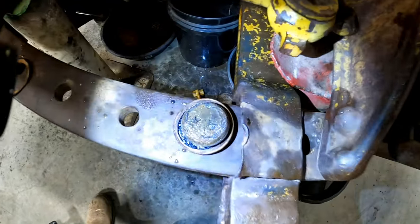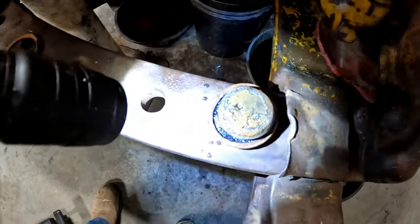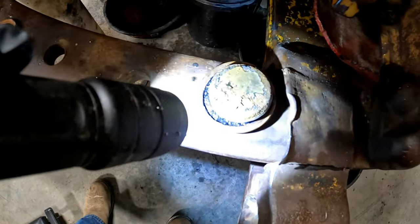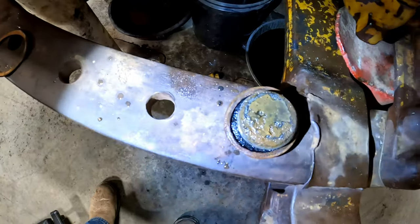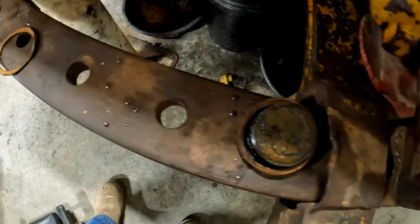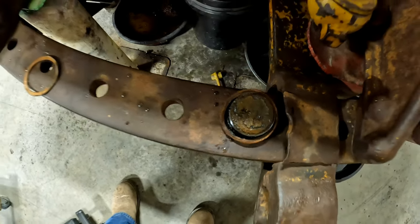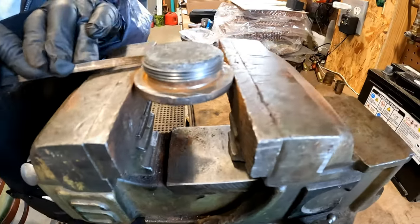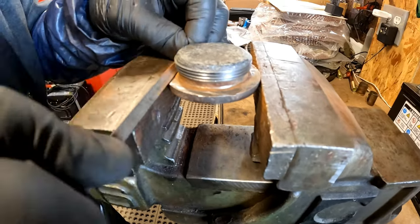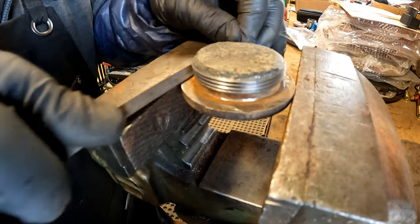What Dad's saying is this copper ring being the wrong size here, the water got down in there next to it, and it made a rust ring around the bottom of the plug, and that is why those went out so difficult. So he's over on the bench with a file cleaning up those threads. Dad's got quite a bit of rust off of there where it was in between that copper O-ring and the threads, and that is why we fought that so bad.